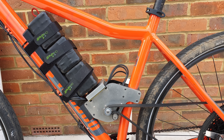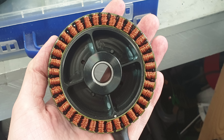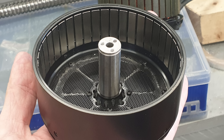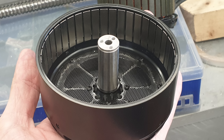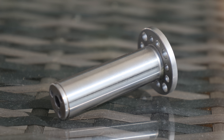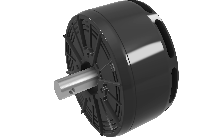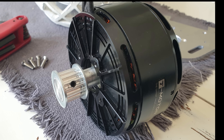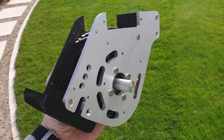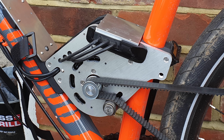This was the final design for the next year and a half, when I decided to upgrade the motor. The diameter of this new motor is 25% larger than the previous one and it has 42 magnets instead of 14. The only problem is this motor lacked an output shaft long enough to mount a pulley, as it's designed for mounting propellers. So I had to make my own shaft which would bolt to the motor housing, pass through all the bearings, and attach to a pulley. This could then be bolted to a new aluminium motor mount, with the other mount plate cut from 3mm carbon fibre to avoid the magnetic motor issues again, and it fit nicely inside the frame.